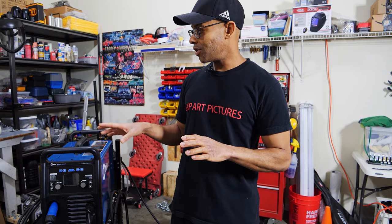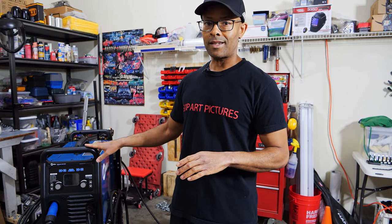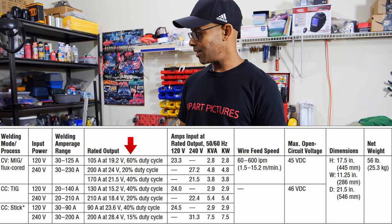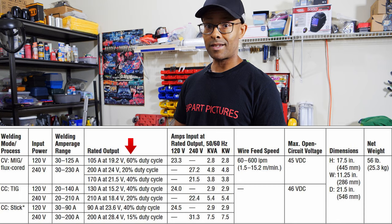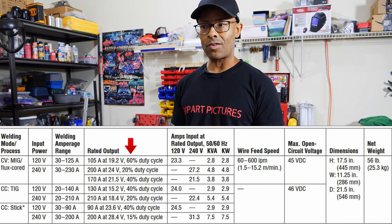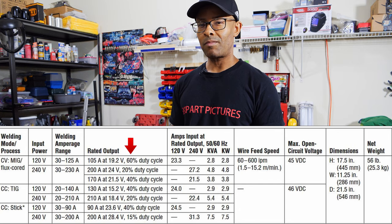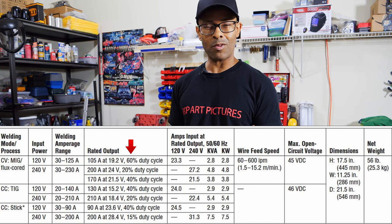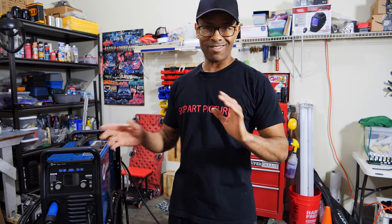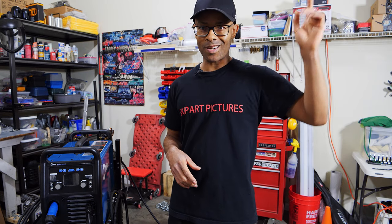Plus, another big seller is that from this price point down, the duty cycle is probably the highest that I saw when I was looking at welders. The duty cycle for this is 60% for MIG, and then I think 40% for TIG and shielded metal arc welding. I think it's 40, I could be wrong on that. Maybe it's 20. But I will put the specs and links in the description, so don't worry.